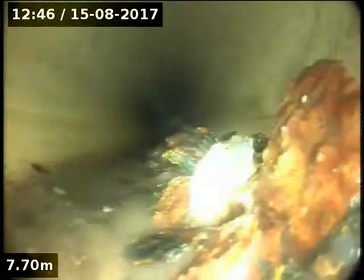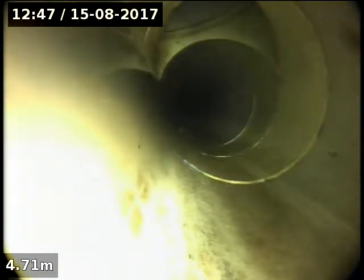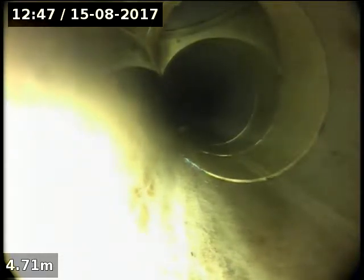Underneath, we've got to locate it here now. A little bit of rubbish there. So it's 0.7 deep, just on the inside of the step wall in the garden side. Coming back, there's a junction right there. That's potentially, probably from the pool, I'm not sure. We'll locate that.